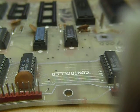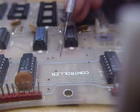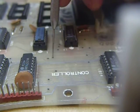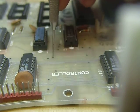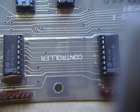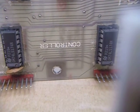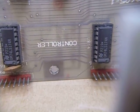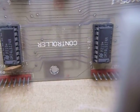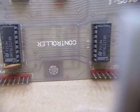They used to put jumper wires on circuit boards. You may see this circuit board here does not have jumper wires. What they do is they put a through-plated hole — the conductor goes through the hole and comes out the other side of the board and goes to another point. By doing that they eliminate jumper wires. Those through-plated holes are hollow; when they make the circuit board they put it in a plating bath, and that bath plates the inside of the holes so the conductor goes all the way through.